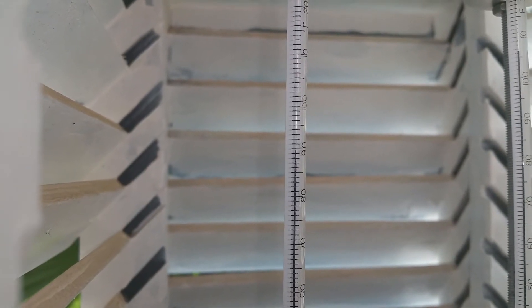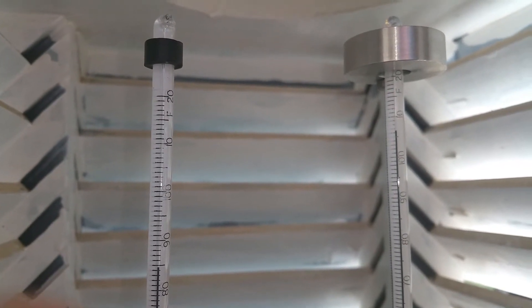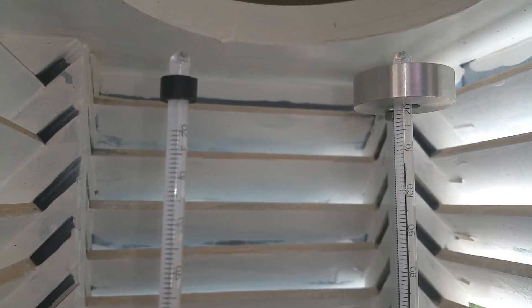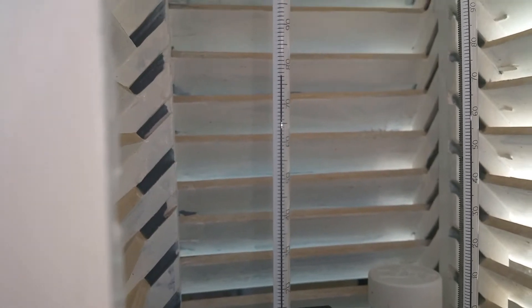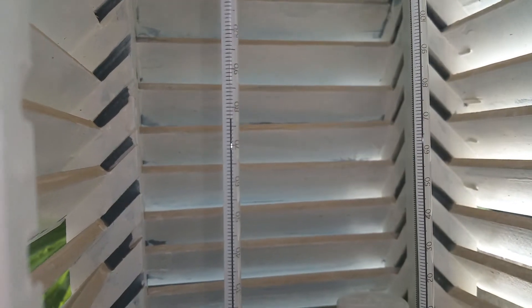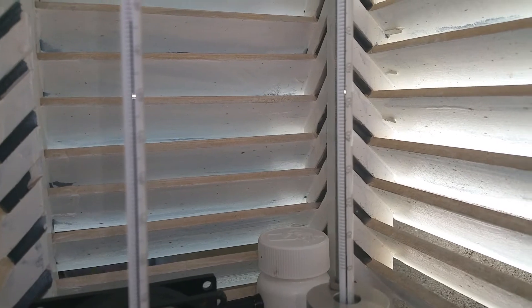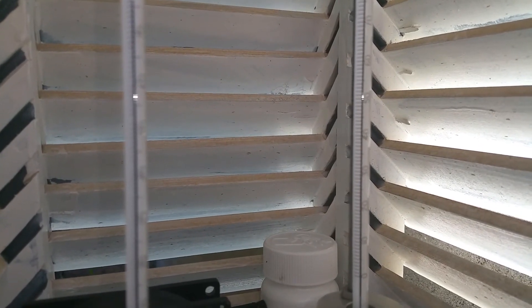Once this is settled for a couple minutes, I'm going to enter the wet bulb temperature and the dry bulb temperature into an app I have, and it will give me my dew point and my relative humidity. We got 108 on the dry bulb and then around 76 on the wet bulb. Put that into your app or any type of calculator you have and you'll get the dew point and the relative humidity — which today happens to be 21% RH and a dew point of 59 degrees Fahrenheit.